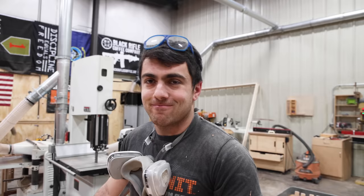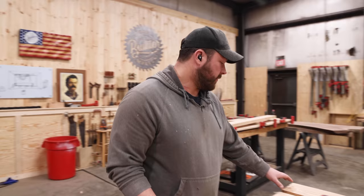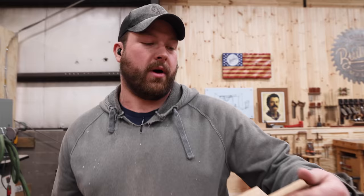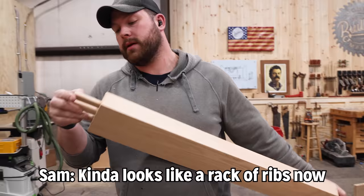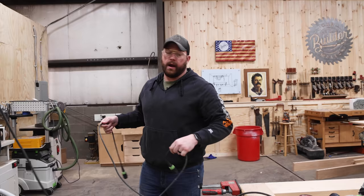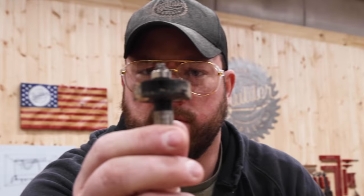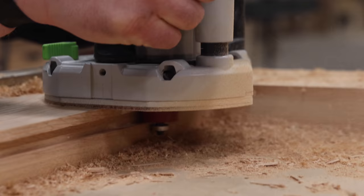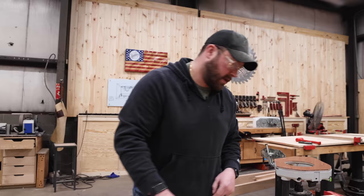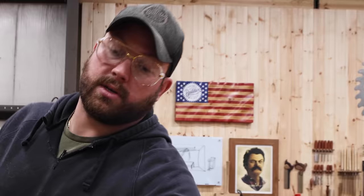It's been a dusty day in the pig pen. We are mocking the door up before we cut our groove. Sam and I oversized and then way undersized the dominoes, but one thing we like to do is put our dominoes in one side so they're like a tenon - they become basically an integral tenon. Next step is we have to route the panel groove. We have this slot cutter bit with a ball bearing on it - the bearing runs on the inside and that slot cuts down to the depth I'm looking for. I glued some panels up over the weekend - those are ready to rock and roll.